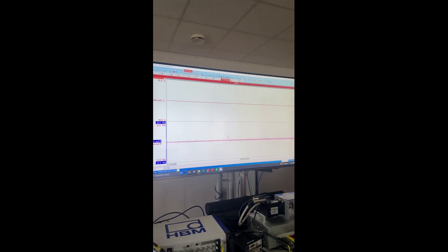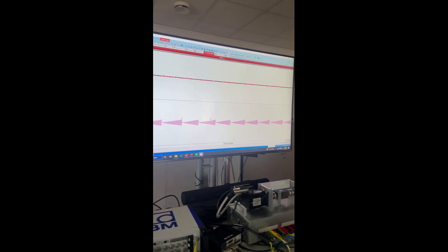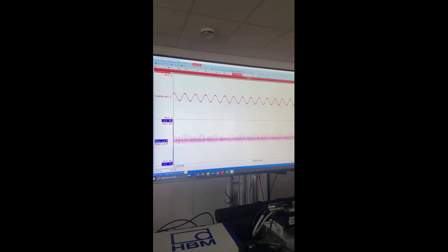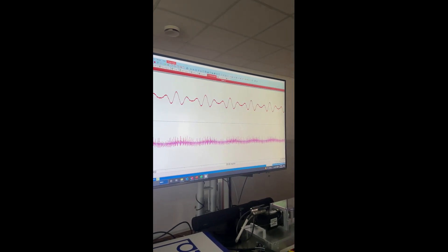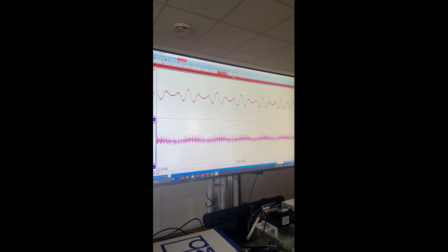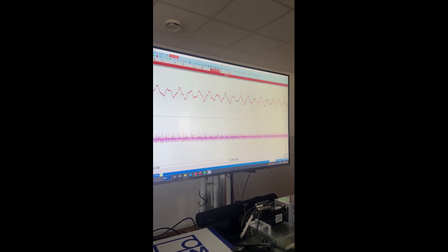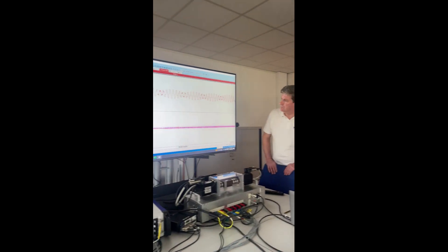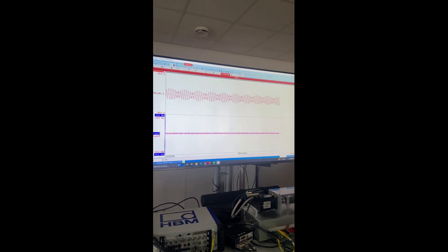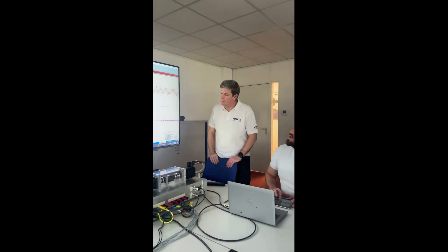We can show the exact opposite in the rig. We have a torque ripple feature in our cool new rig here. Let's go to torque ripple — let's throw some speed, a little baseline torque. We can introduce a mechanical ripple where we can see our current getting really kind of crazy, and our torque starts having a frequency to it. Or even better, we can inject a frequency ripple where my currents get really funny, and again our torque goes a little crazy. If I mess around with the frequency of my current, I can change that torque behavior.